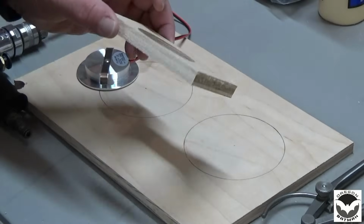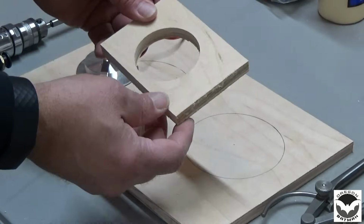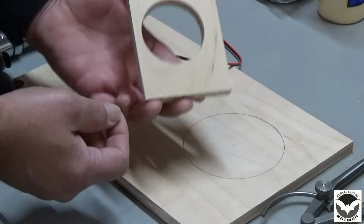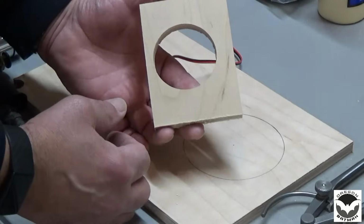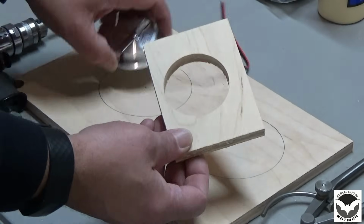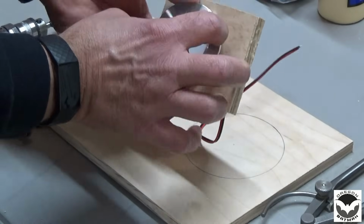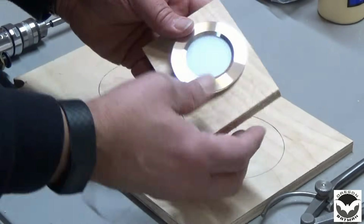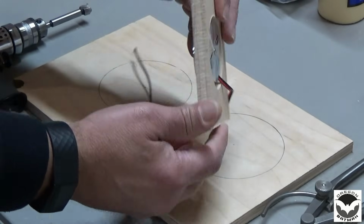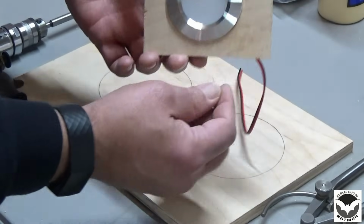So this is just a test sample for my backer block. I wanted to make sure that I've got the correct size hole in order to install our light. And for that, it actually took a 2 3/8 inch hole saw. So I just drilled one in the wood, took my wiring, put it in place, took my light, and snapped it in. So I think that's going to look pretty nice in there